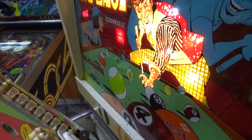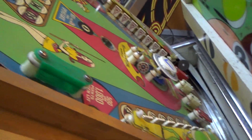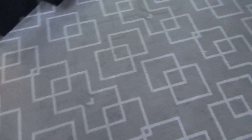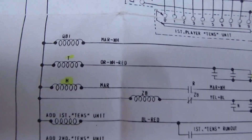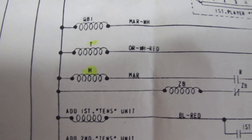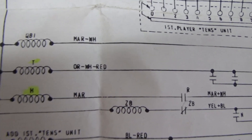I put it back in and we have the tilt light on and the game-over light on. Whenever you start it, it does the same thing — the lights never come on. So you know what time it is: schematic time. Here are the schematics. The T relay is the tilt relay — see how someone has highlighted that. We are walking in the footsteps of another repairman. He's got the T relay highlighted because it says tilt, so he's thinking it's tilted.